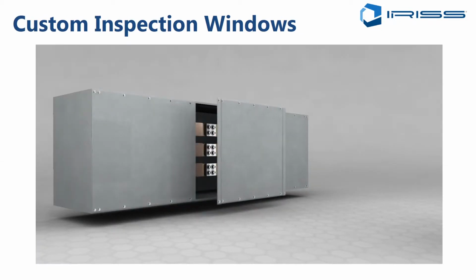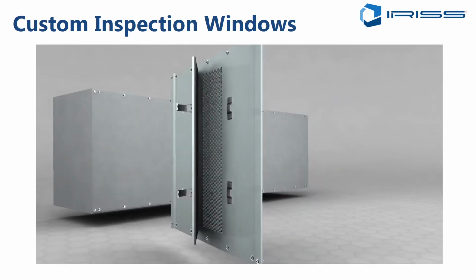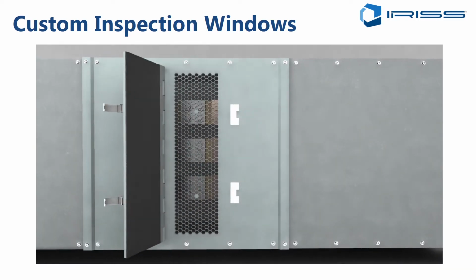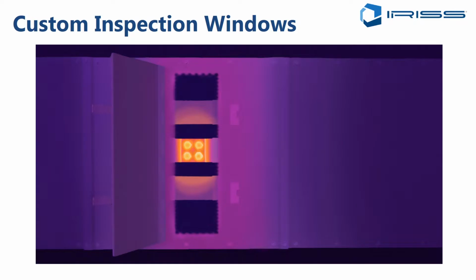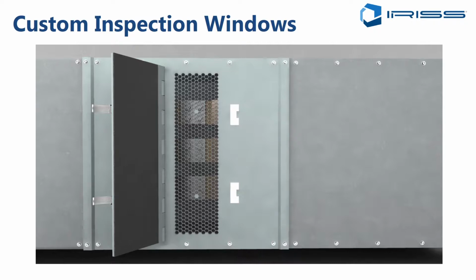Here we see an example of a custom solution. In the custom solution, the original panel is taken off, removed, discarded, or recycled, and it's replaced with a unit where the infrared window has been built straight in. This allows the customer to do the installation much faster as there's no cutting or touch-up painting required. It's simply a matter of removing the old panel and adding the new panel in its place. In addition, these units can provide an access point for future maintenance. So not only does it become an inspection point for infrared, ultrasound, ultraviolet, visual inspection, but it also becomes a point of maintenance access.